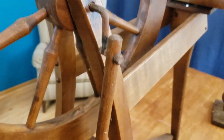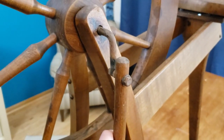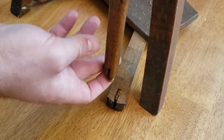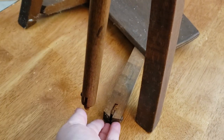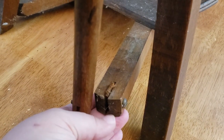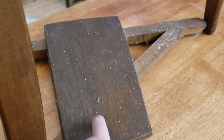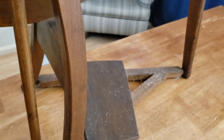Let's take a look at the footman, which is the piece that connects the crank to the treadle. The crank is horribly rusty. This is how the footman attaches to the treadle — these are joined sometimes by a plastic piece on newer models, but this one has a leather piece. It broke, so we're going to need to get a new leather piece to connect this up. Generally, the wheel is pretty dusty and has some little plaster dust or paint speckles on it, but I think we can get that all cleaned up with a good oiling and wood conditioning.